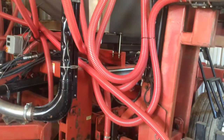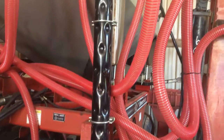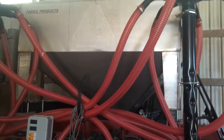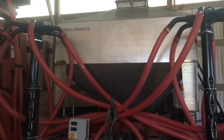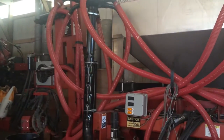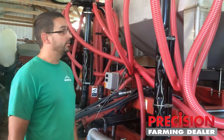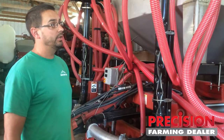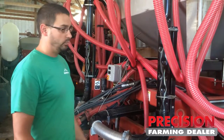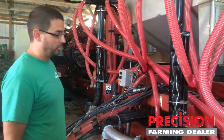Some of the things about this box that we didn't have any experience with was the distribution system and the meter. I know a lot of guys talk about the Montag system with every hose having a meter, and that's probably the best, but we didn't have a Montag budget, so we got this, and I gotta say that it works really well. We weighed out all 12 rows, and row-to-row consistency is probably within 5% using a scale, so I think that's more than good enough for what I'm doing.